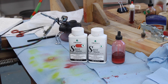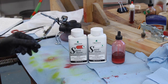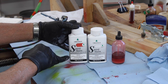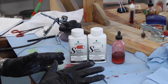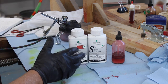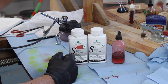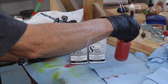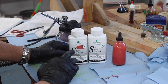Here's another really good product that I love — it's a stain. This is a Chestnut spirit stain, which means it's thinned down with denatured alcohol — not lacquer thinner. I can also put that into my vessel, and that's the next color I'm going to put into the main piece up here, which started out green.